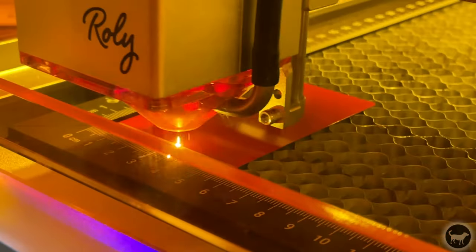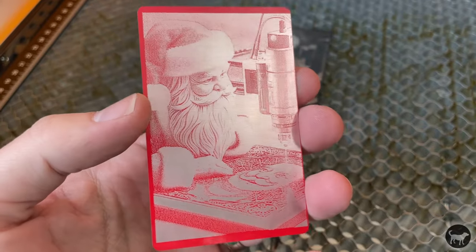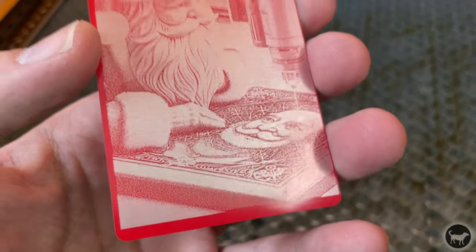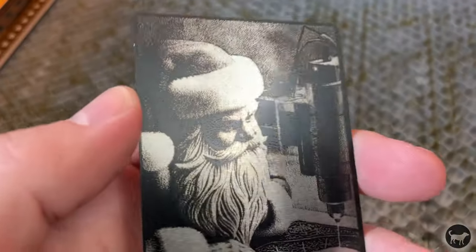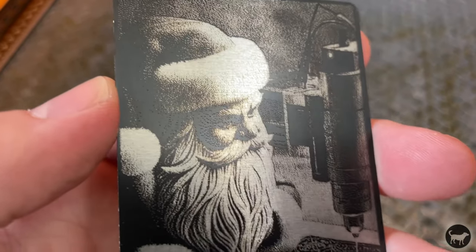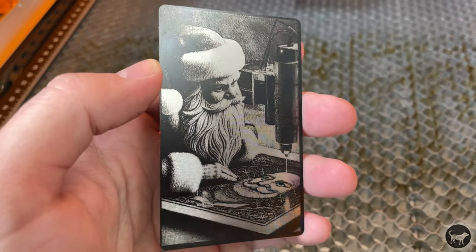After this, I wanted to try one of those metal business cards that come in the kit. Again, to keep with the Christmas theme, I decided to engrave Santa. The image came out great, and since I was using the honeycomb for absolute coordinates, it engraved exactly where I wanted it to. I ran this at 1800 millimeters per minute at 30% power and 318 dpi using the 10-watt laser. It came out pretty nice. I also wanted to run this again on a black business card, but this time I switched the dpi to 254. It still came out pretty nice and detailed, but at much less time since I effectively lowered the resolution.